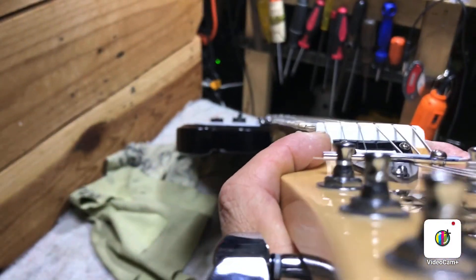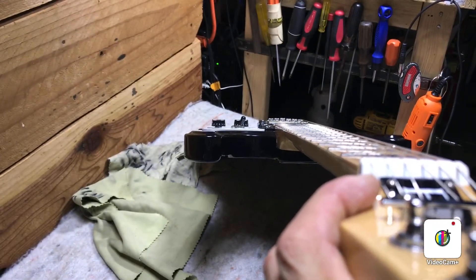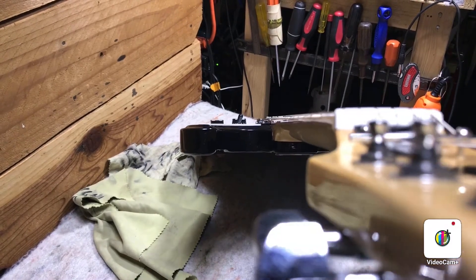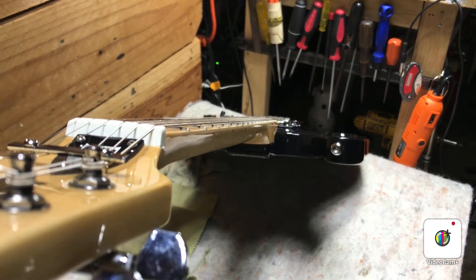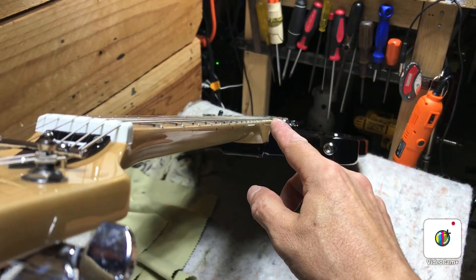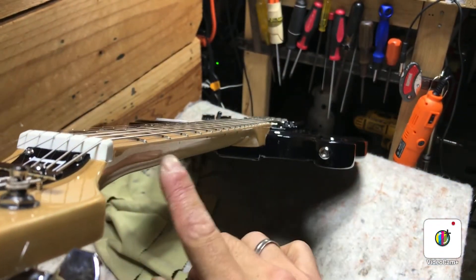The neck isn't always uniform in relief all the way across, and that's not the end of the world — you can still set up a guitar quite well with a little difference. But if it gets too far in that direction, it can be a real problem. It can be hard to see at first. Read about it, look at diagrams online, and just do it again and again — your eyes start looking for the wood going down a little bit underneath the string, because the string is your straight edge. Less often, but it does happen, it's called back bow, where the neck goes up and it's a D-shape in the middle coming up towards the string.